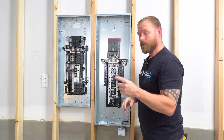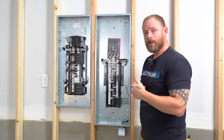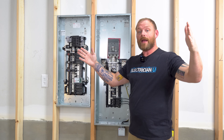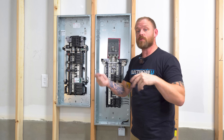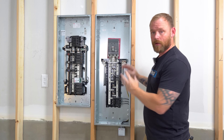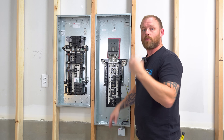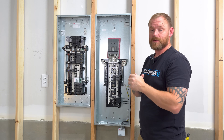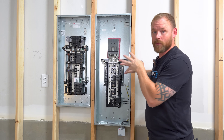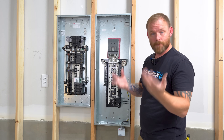What you want to be really careful about is when putting wires in, you want as little lead length as possible. From the manufacturer they've got a certain set of leads — you don't want to extend them and make them longer because you're adding more impedance, which is bad. You want a low impedance path as much as possible on all of these conductors. It has to do with the delay that happens for surge protection to activate — the longer the lead length, the more delay, so the least amount of impedance possible, the better.